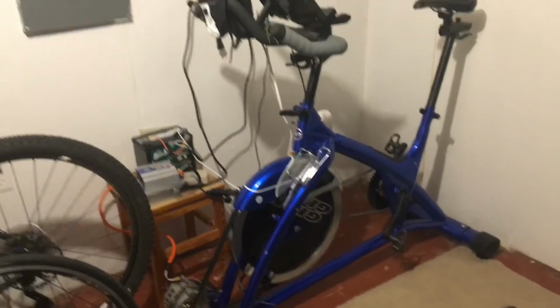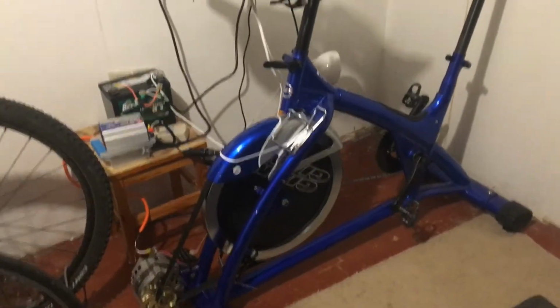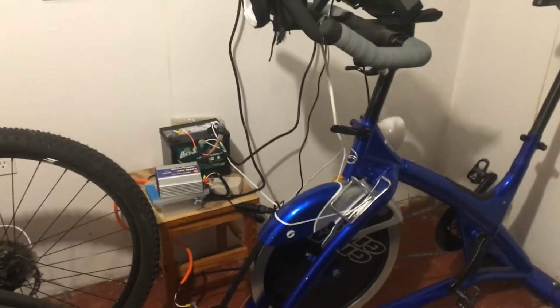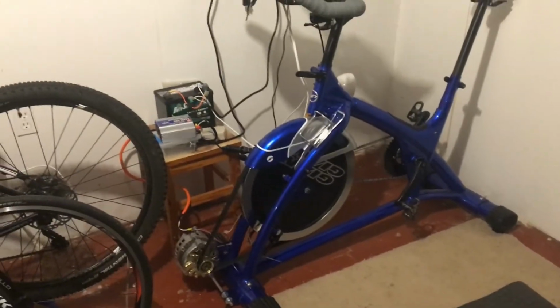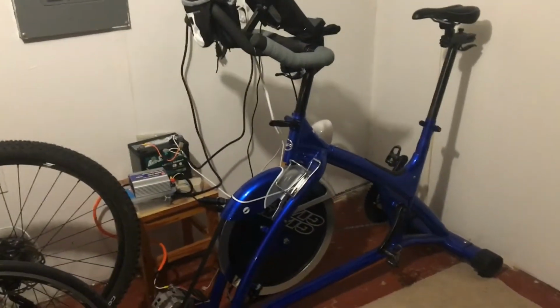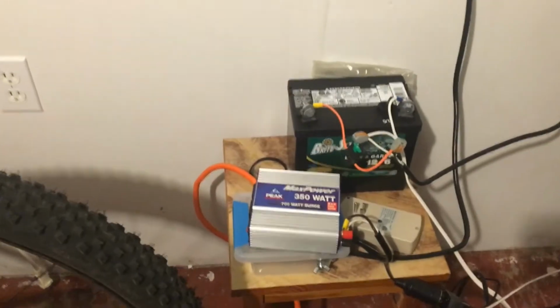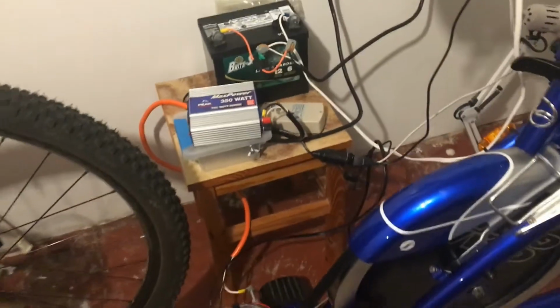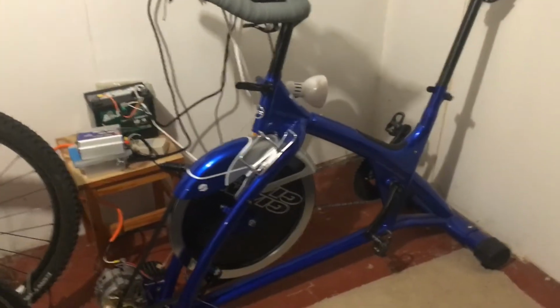But like I said, strong cyclists can put out 300 watts. Pro level can put out probably 400 watts, and I could be wrong on this. You can read about that more than I did, I just pulled that off the top of my head. Whatever class of cyclist you put yourself in, cut that in half, because the alternator is not efficient. The belt drive, you lose some efficiency there. You lose some efficiency at the chain drag. You lose some efficiency at the inverter. So don't expect to power more than 50% of how much power you can put out as a cyclist.